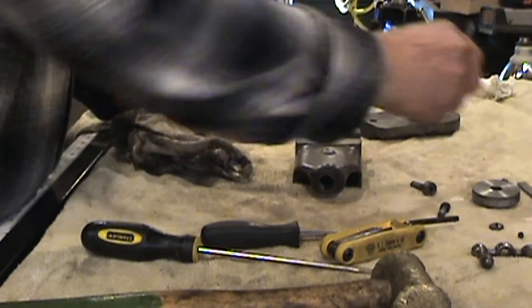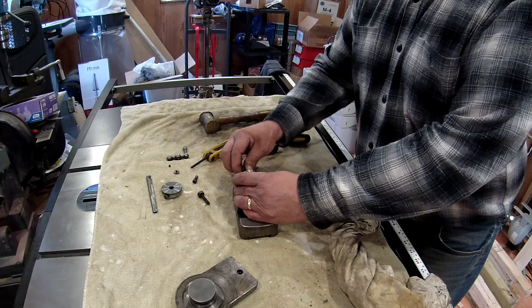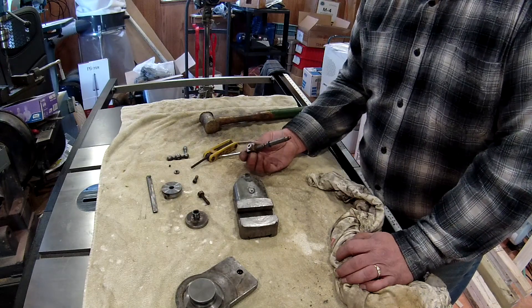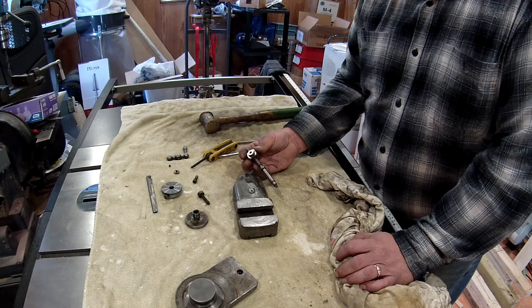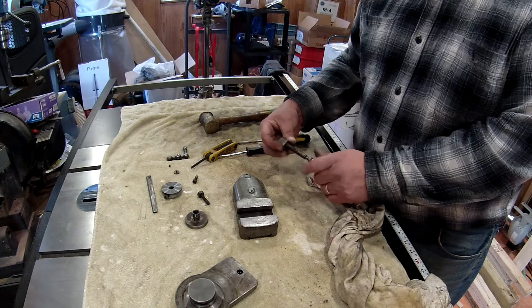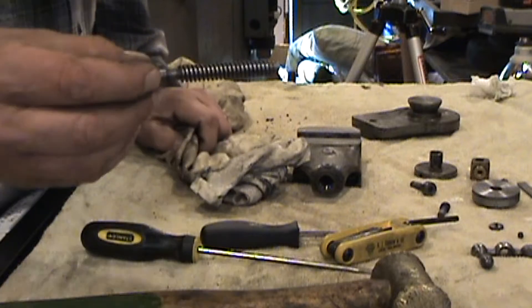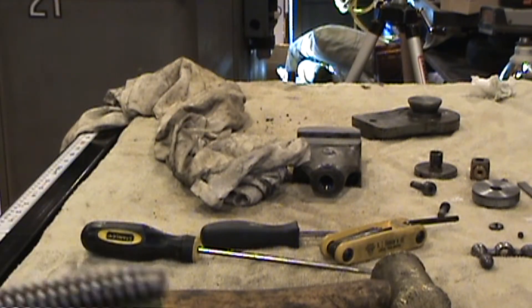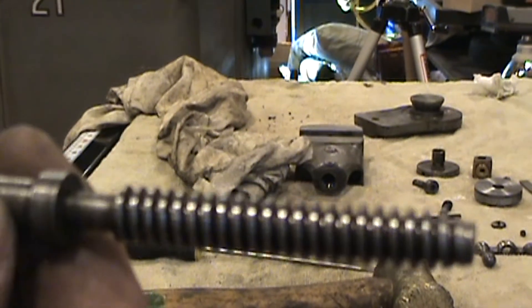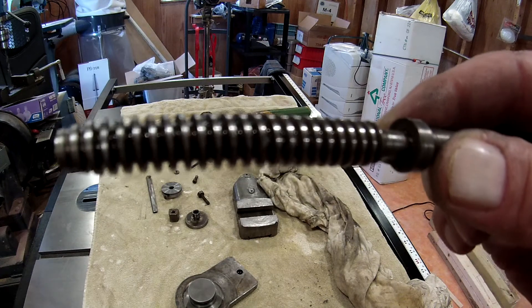As to the bushing — see how tight that is in the bushing. Just a little wiggle, hardly any. So that's actually excellent. I don't think I need another nut and I don't think I need another screw. The top of the threads are still pretty shiny, and it looks like all the tops are pretty much the same width. I don't really see any issues with wear — they look pretty good actually.